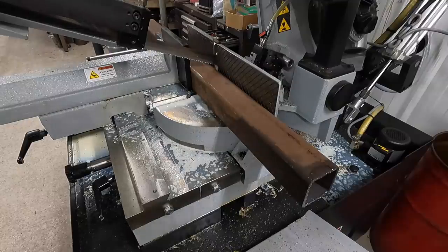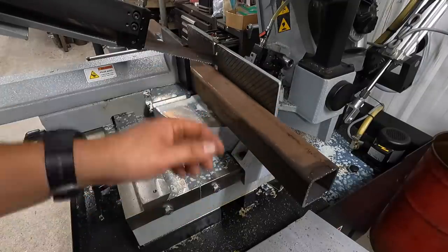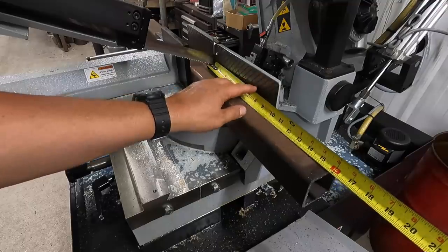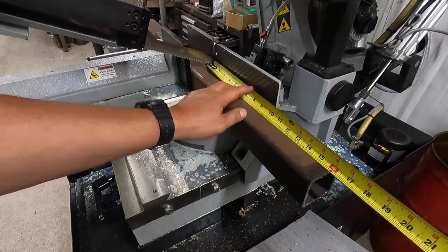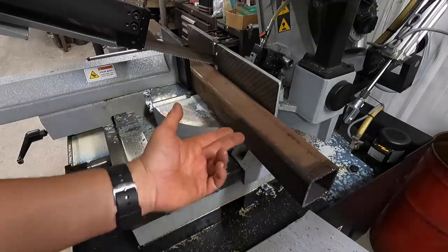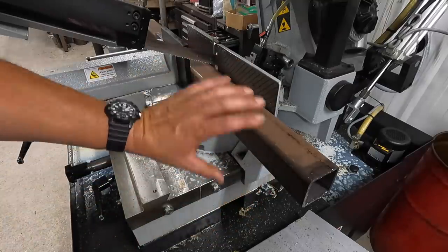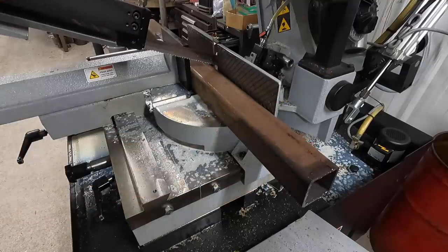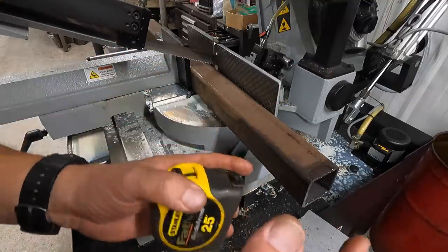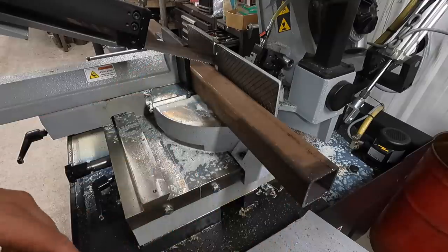All right, last piece of tubing to cut here. This is the part that is going to slip into the receiver on the truck, and your large 3-inch tube will be welded out here. I'm going to cut it 16 inches long. It's probably going to be just a little bit longer than we need, but if I need to, I can trim this. But all we're going to be doing is just drilling maybe a couple holes in here for the pin to go through. And there's plenty of clearance behind the hitch for this to slide through. It's just hard to gauge exactly where it needs to be until we start assembling this and finding out where the crane itself is going to be positioned, in or out from the truck.